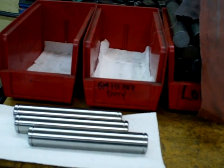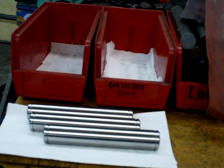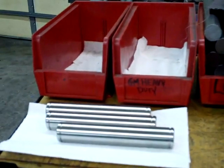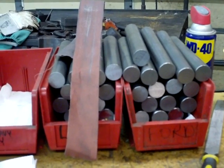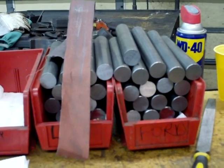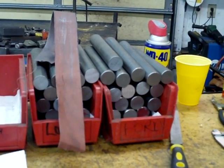I'm doing those because the raw materials have been camping out and I need one this weekend. The others are the same operation — they look the same — but those are 4140 steel and every one has to be cooked for about three to five hours to temper them. I've got to do them all at once because I'm not going to fire up the temper oven for just one or two. So I'm going to do these stainless ones instead — they come out pretty. I only need one this weekend but I'll do them all.